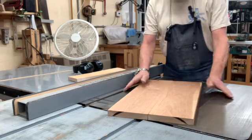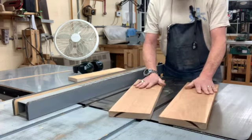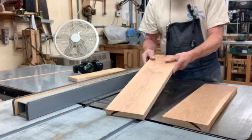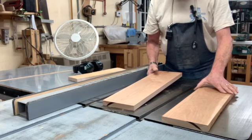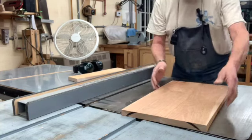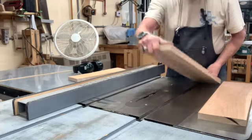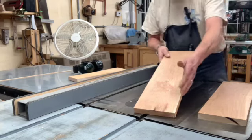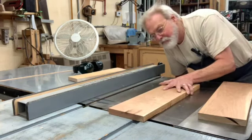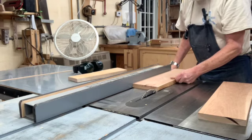So now I've brought my lumber to the desired thickness — we've got flat surfaces, the opposite surfaces are parallel and smooth, and I have a jointed edge, but I don't necessarily have parallel edges yet on either of these pieces. If I just want to glue them up and then treat that as another whole board by jointing an edge and ripping to width, I can do that. But let's assume we're going to cut strips out of this. I'm just going to rip these out as wide as the boards will bear. Adjusting my saw, and we're just going to get them as wide as possible.